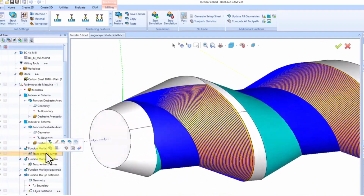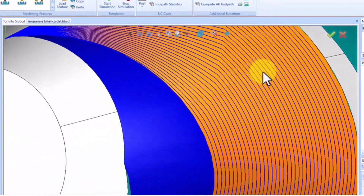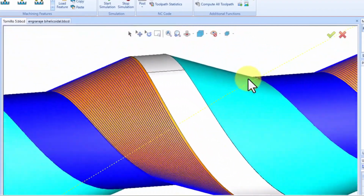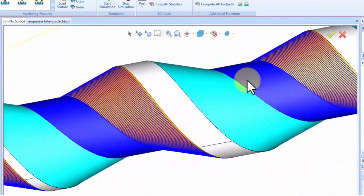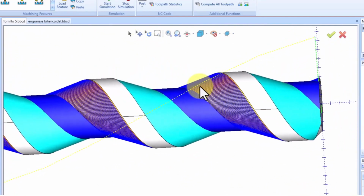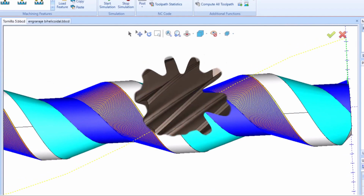And the magic happens during finishing. Watch as the tool gracefully moves in X, Y, Z, and A axis simultaneously. This is true 4-axis interpolation in action. We're not just following the surface for an impeccable finish, but also drastically reducing our cutting time.